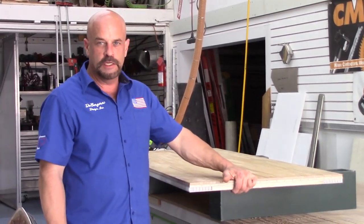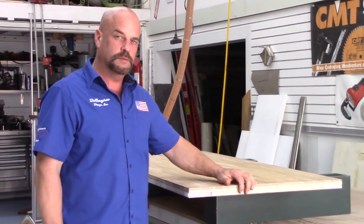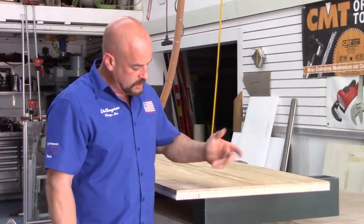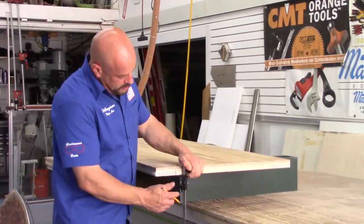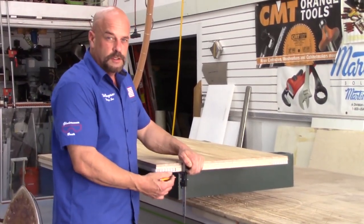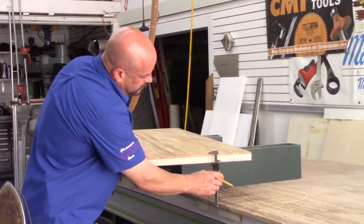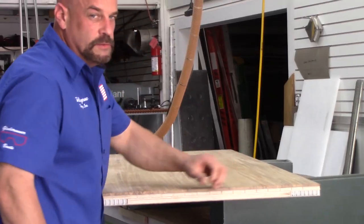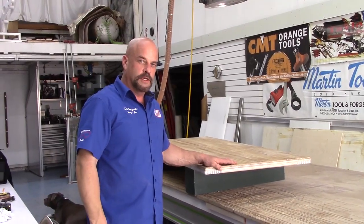So I laid up this panel last night. I trimmed all of the excess mica and biaxial cloth off the edge. After I trimmed it, I measured it. That measurement is 1,422 thousandths. Moving over to this other spot — 1,421 thousandths in that spot. So from here to there on the panel, it's a thousandth of an inch difference. We'll get to putting the moldings on now.